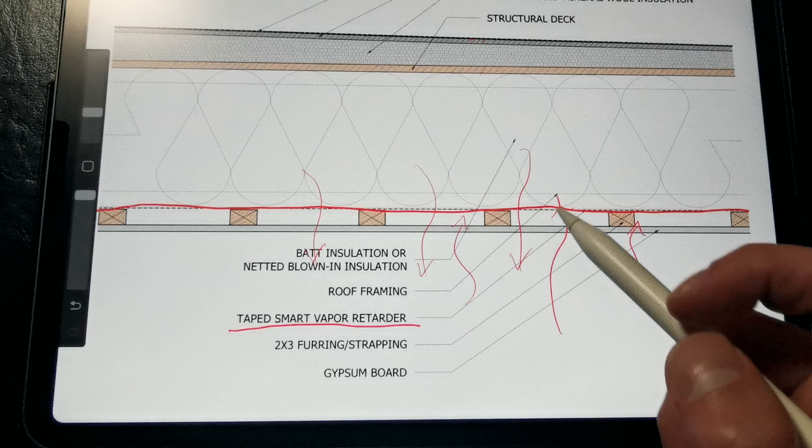We get a really strong adhesive bond to that spray foam layer. We also get a really fast installation with this type of system because we don't have to wait for very long cure times for the adhesive. The spray foam also cures very quickly, we don't have to install an additional air and vapor barrier, we don't have to stack and stagger rigid insulation layers — so there are a lot of benefits to using this type of assembly for retrofits and new construction. As mentioned before, there are some downsides to using spray foam, particularly the off-gassing that can occur. There are some lower VOC options on the market, however there can still be some issues with lingering odors and off-gassing of harmful odorless chemicals. One way to reduce the effects of this is to tape or air seal the roof deck from the spray foam layer so interior air doesn't come into contact with the underside of the spray foam and circulate those off-gassing chemicals back to the interior. Also, allowing that closed-cell spray foam to off-gas as much as possible prior to sealing the roof assembly with the roof membrane will help immensely.